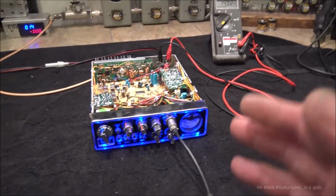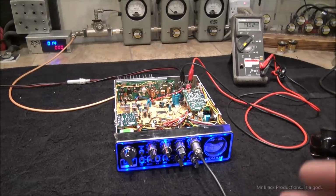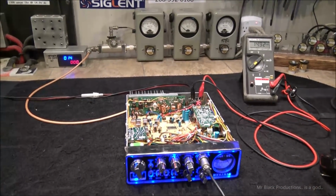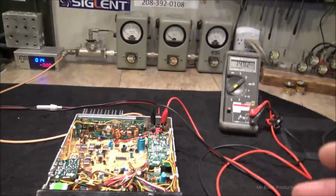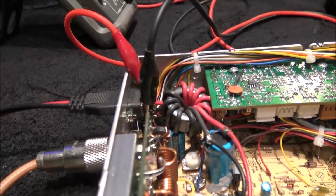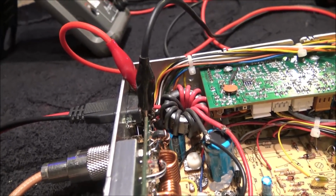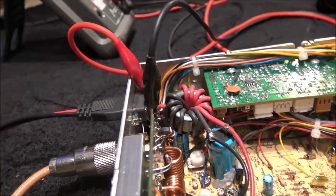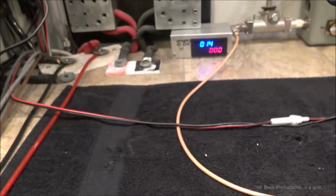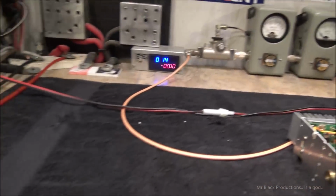So what I want to show you is that power wire makes a huge difference. I was just having a debate with my friend on the phone. And yes, there is some significant amperage loss that takes place here at the plug at the back of the radio. This little 3-pin plug is woefully inadequate for what we do with it. But my argument with him was that actually most of our loss is in this cable and in the fuse holder.